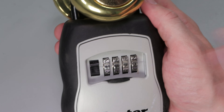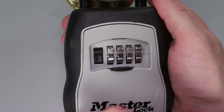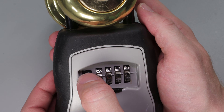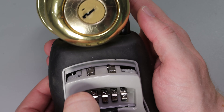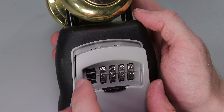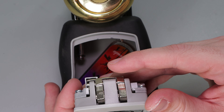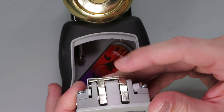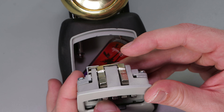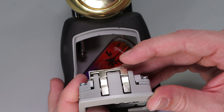We can see that the digits are going right across the middle, in alignment with that bar. All we need to do to get it open is pull this down and the front will open right up. Now if we had the wrong code in, we would not be able to pull that bar down. You can see this mechanism right here — with the wrong code we don't get a full open, but with the right code we can really pull that down. If I change it to a 2 in position 1, you can see that it doesn't pull down all the way.